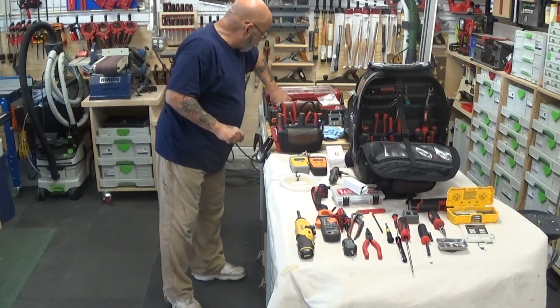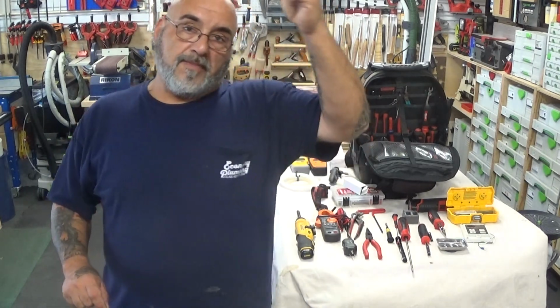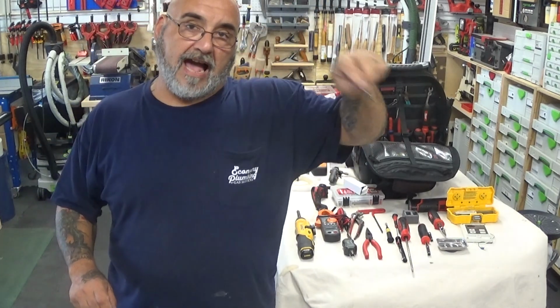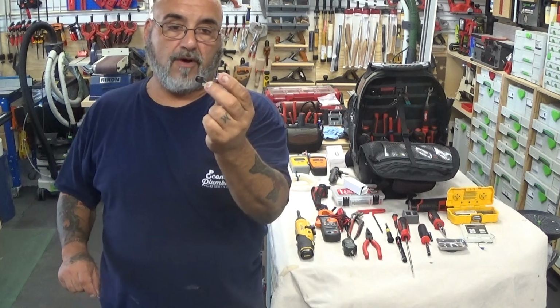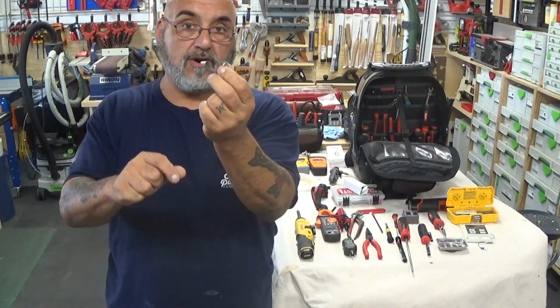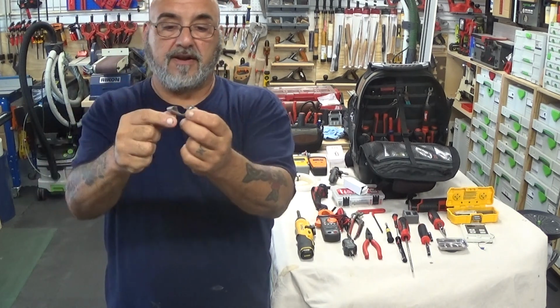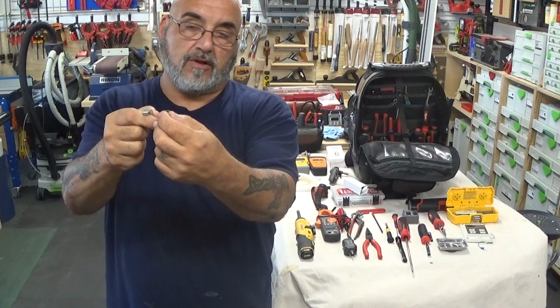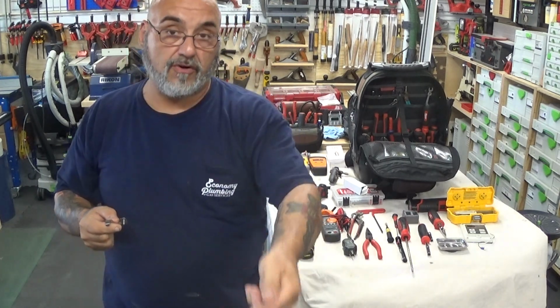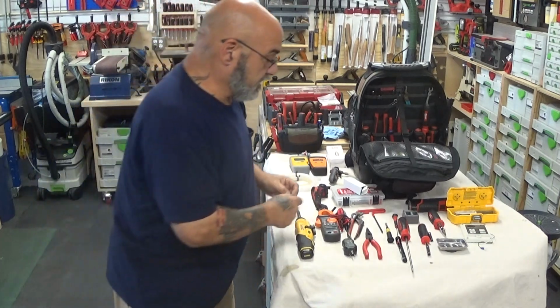the clips from the heat exchanger down into the outlet side and the water servo valve. These clips hold the heat exchanger in. That's the screw that goes into it, that locks it in. It clips onto a brass part, and this here will screw it in. And then the last screw is this machine screw.